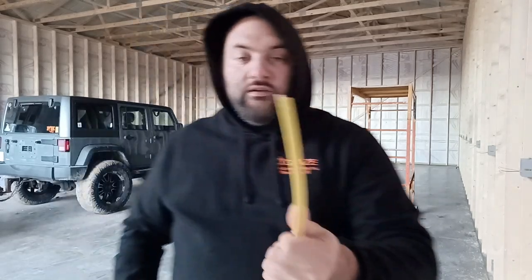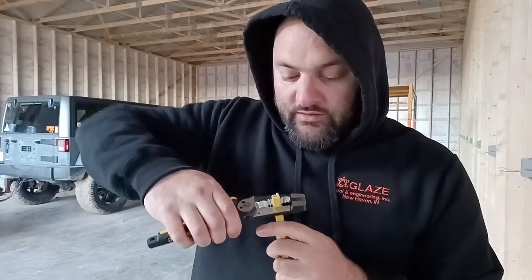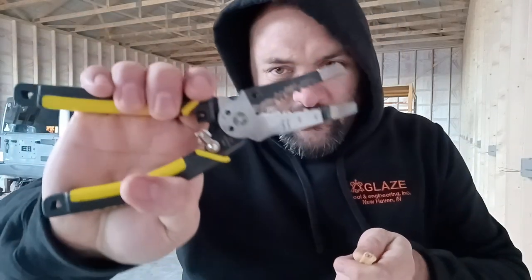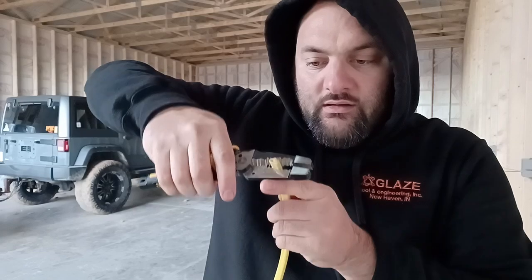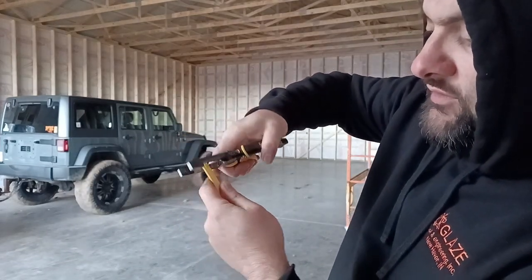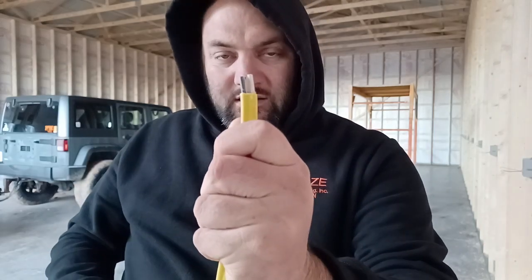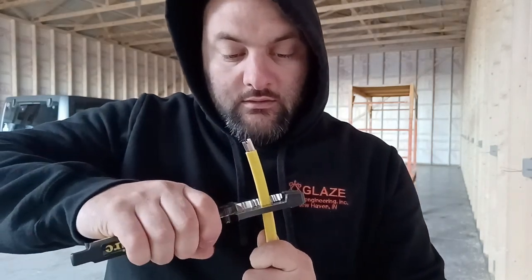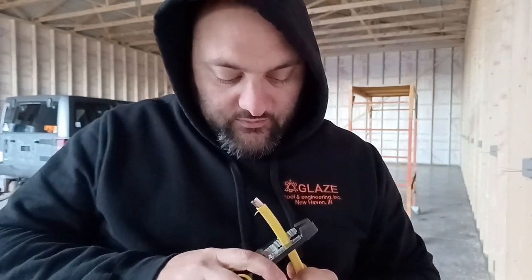Here's a section of 12-2. The nice thing is you can strip the entire thing at once. You just put this in the 12-2 area — it's thick — and if you just want to do a short amount you can line it up with the edge, just like that. Or if you want to do a bigger section, it's easier when it's in the outlet because then you have something to pull against.